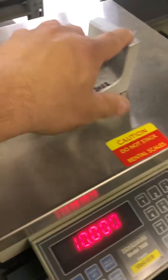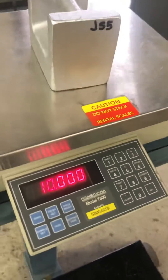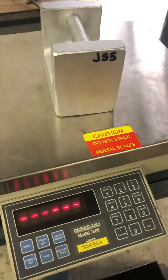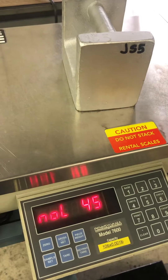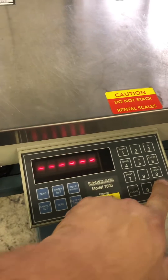It asks for 10, because the Pennsylvania 7600 range always asks for a zero, a half, a full, and then a zero again. So you apply your 10 pounds and hit enter. Then it asks for another zero — move the weight and press enter.